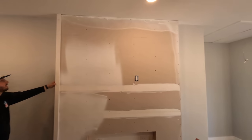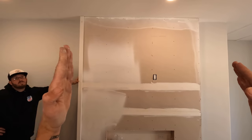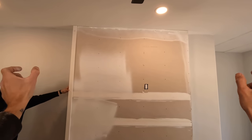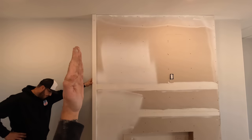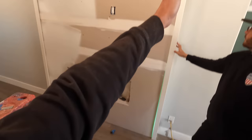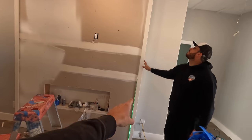Making the other side now. Before attaching, I want to make sure the distance stays consistent and neither piece of drywall is bowing out — now I have time to cheat the trim slightly for nice straight cuts. Both side pieces are made. I'm using the laser to shoot a plumb line up so both sides are plumb, and doing a check in between to make sure we're not dealing with a weird angle cut for the shiplap that runs all the way up. Looking good — she's nice and plumb.